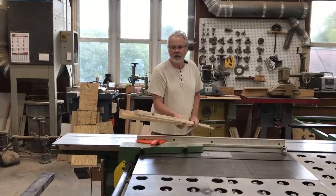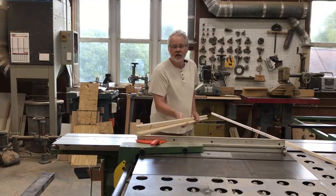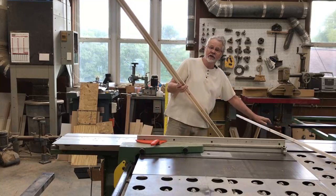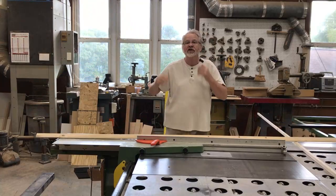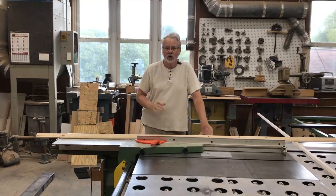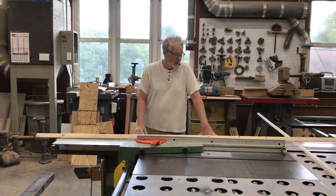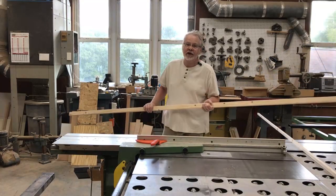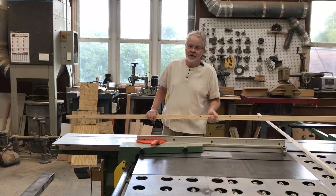So what I did basically was two cuts, an inch deep, half inch off the fence, and I created the outside corner molding. Now, our ceiling height in our project is over 8 foot. We're almost 9 feet. So we would have had to buy 3 outside corners at $29 a piece. That's almost 90 bucks. I've got $6 in a 2x4 and 15 minutes of time, and they wonder how come their sales are down.